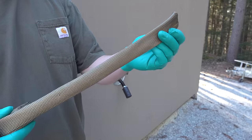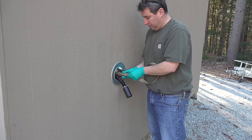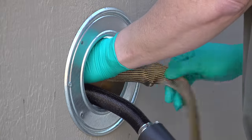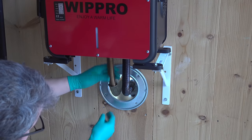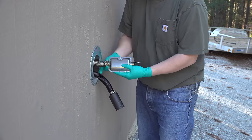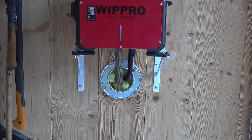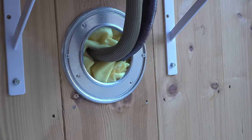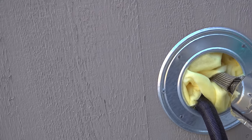This exhaust wrap can be super helpful — slide it over the exhaust pipe. It's often used for exhaust pipes for generators and racing headers, and it gives you fireproof protection and extra insulation along that pipe. I also wanted to insulate the space around those pipes to keep out mice and other pests. I'm using the included muffler along with the air intake muffler. It's really important that you do not repeat the mistake I'm going to show you here. I saw many messages online saying you could use regular pipe insulation around these pipes — the air intake pipe stays completely cool, and the exhaust has that fabric wrap on it, so I was pretty sure the regular insulation would be safe.